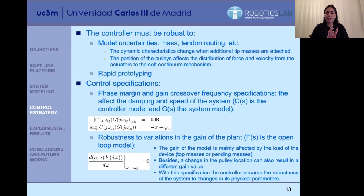We selected three main control specifications. The first two are typical: phase margin and gain crossover frequency, which let us select the speed and overshoot of the system. The third one is to guarantee robustness to mass changes on top. This works as follows: we want the controller connected to the plant so that the open loop guarantees a flat phase around the gain crossover frequency. If the phase is flat around the gain crossover frequency and I change the gain of the system, the phase margin stays the same — so changing masses implies changing gains but will not affect the overshoot.